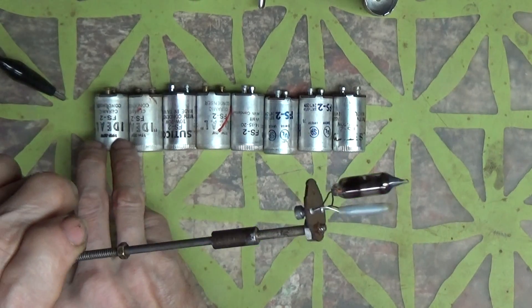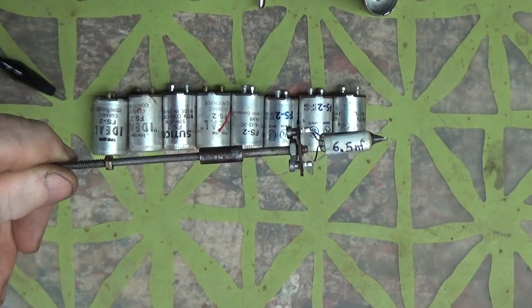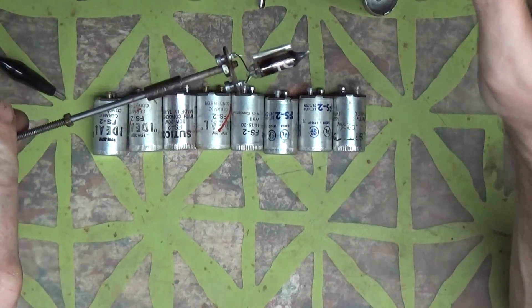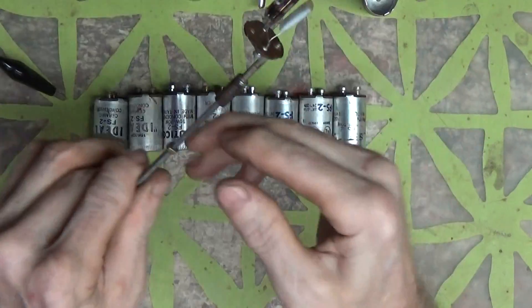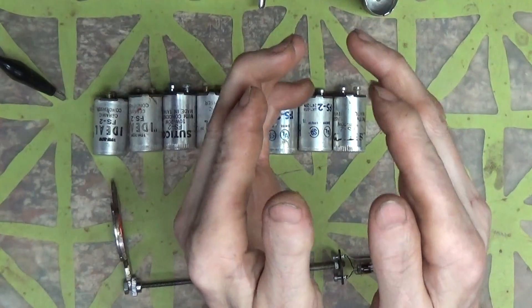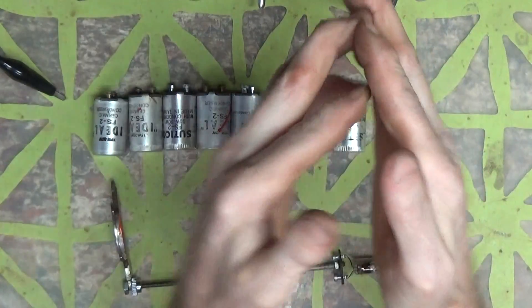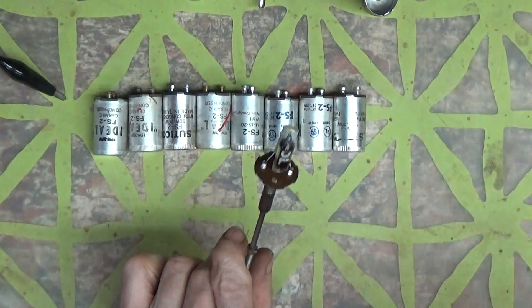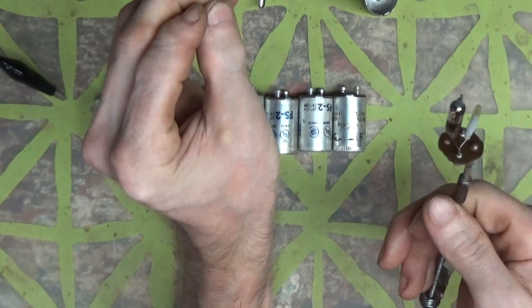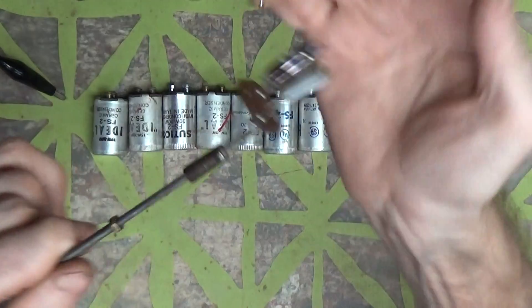Professionally you call it a ceramic condenser. You've got the capacitor here — it measures 6.5 nanofarads. And then you have basically a miniature bulb, but it's not a bulb at all. It has a piece of metal — bimetal is what they call it. When it heats up, one metal expands faster than the other, which makes it want to bend. When it bends it completes the circuit — so it measures OL right now. Once you get house voltage going across it, it starts to heat up and when it does it contacts and completes the circuit, which lets it kick into the filament.